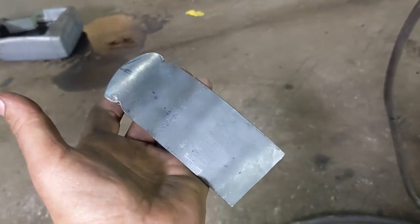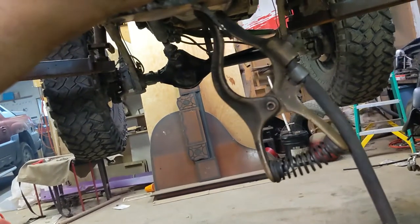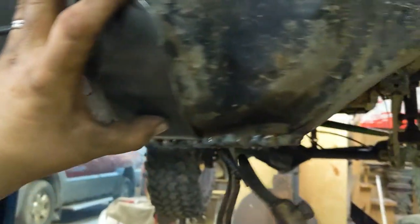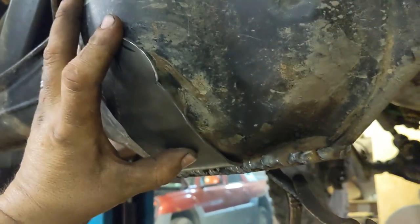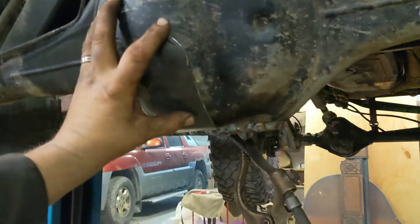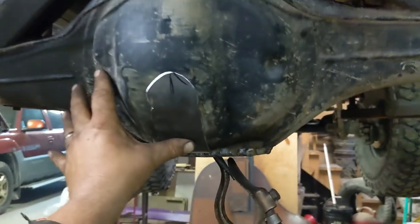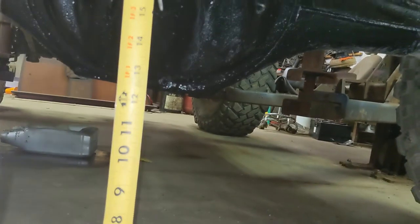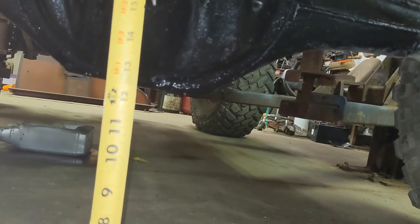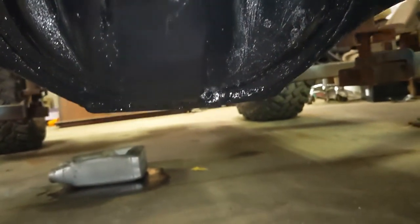Use the press brake again to bend up a chunk of steel that's going to go in the back — kind of support that rib. It's not as thick, it's only an eighth inch, but an eighth inch on top of more eighth inch is going to give it that quarter — it's definitely going to add some strength. The flash is making it a little difficult, but we're at about 12 and a half inches of clearance now. Started out about 12, so I guess we only ultimately gained about a half an inch, but we certainly gained a whole bunch of strength in the bottom by going to that quarter-inch plate. I also wrapped this piece up around the back just to double that thickness. Welds are a little ugly because of some gaps — I didn't really form it around the compound radius as well as I would have liked to, but it's definitely strong.